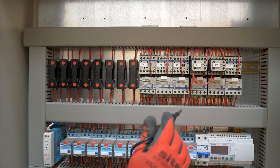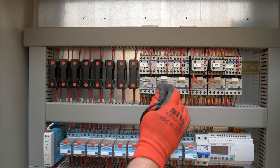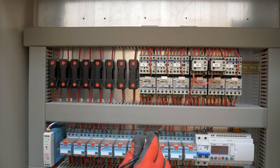If we look up here you can see we've got some of our AC contactors with the various inputs and outputs - the neutral up on here, then lines to provide voltage to the contactor and also the power coming in and out based on what's going on in the wider install. If we press the stop and reset button here you can see that swinging the contactor in and out to test it. Off camera as I'm pressing these, the LED lights are going on and off based on whatever this is switching in and out on the front control panel.